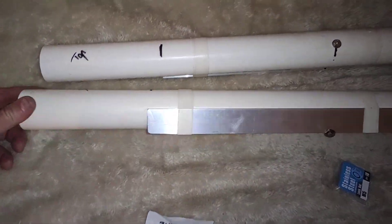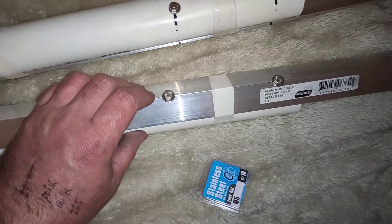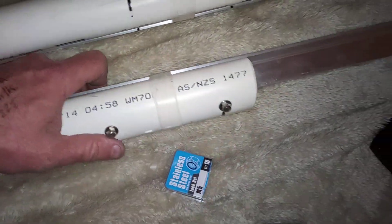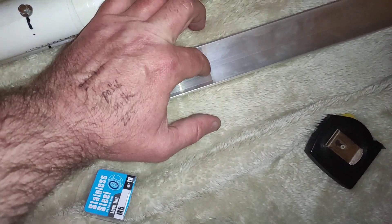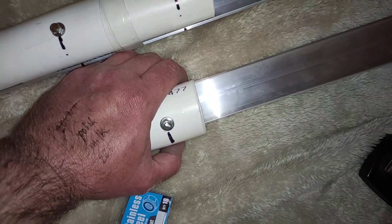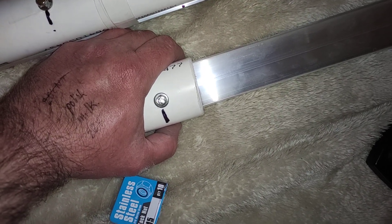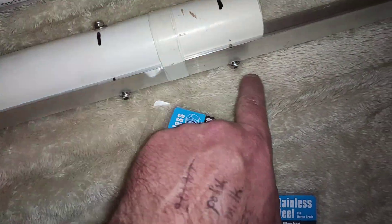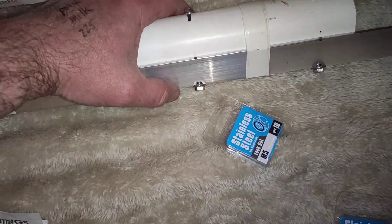Just take your time when you're drilling through this — that's probably the hardest part. You want to drill the holes down into the V. I started with a 4 mil bit to do my pilot holes. Just do these two holes from the inside to outside.